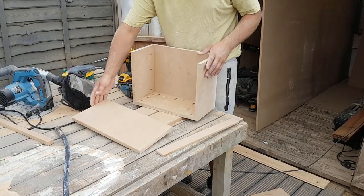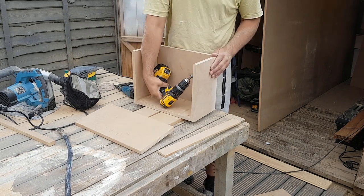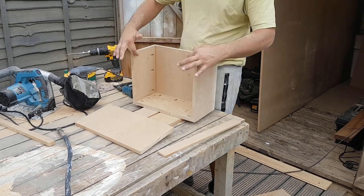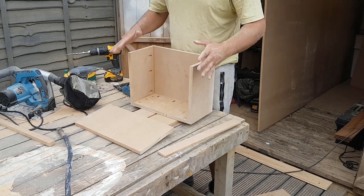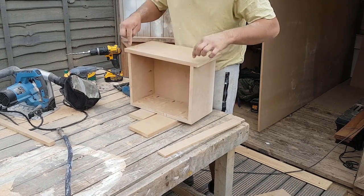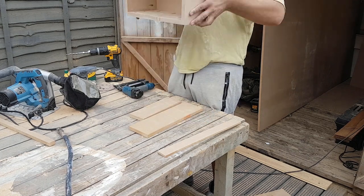Okay folks, confession time, I forgot to drill the pockets in the top and I can't get my drill in to do it. So I was going to put a little cleat inside, but I don't want to infringe on the size of the box, because it's quite a tight fit anyway. So I'm literally just going to glue and put a couple of brads in, and once I fill them you won't see it anyway, and it's going to be quite high up,